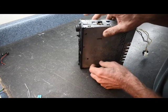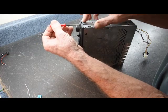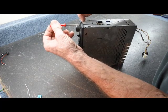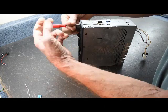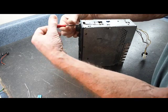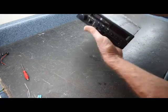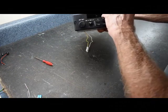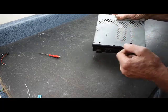And then these tools, when they are tightened through the screw, pull the stereo into the dash, and the dash is secured between this small little opening in front of this tool. So we're going to loosen the opposite side. This will allow the mechanism to go back and sit down, and at this point, as it sits in the dash, you can put your finger in the cassette door opening and should be able to pull this straight out of the dash.